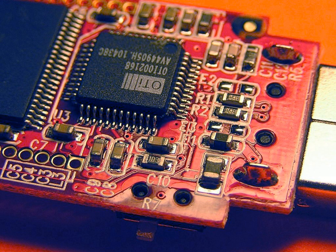Topic: Identification. Topic: Resistors. For 5% precision SMD resistors usually are marked with their resistance values using three digits, two significant digits and a multiplier digit. These are quite often white lettering on a black background, but other colored backgrounds and lettering can be used.